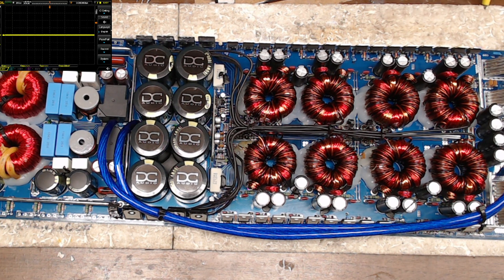I'm also firing up my thermal camera to check the power supply transistors and make sure none of them are abnormally heating up while building the rail voltage. My chassis ground leads are out. The relay kicks in and I get zero heating on the power supply transistors — no heat whatsoever. That tells me we've built rail voltage successfully.